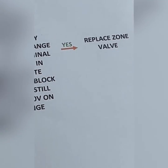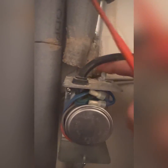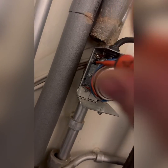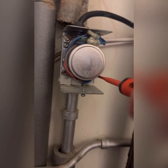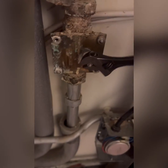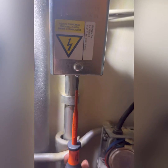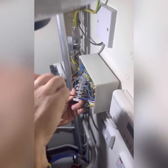So we're going to replace the zone valve. It's electrically faulty so we only need to change the head. We carry these as van stock. So we're going to whip the head off. I'm going to check to make sure the spindle is free — doesn't look great but it operates fine. I'll throw that in the bin, get the new one on, and get it connected up.